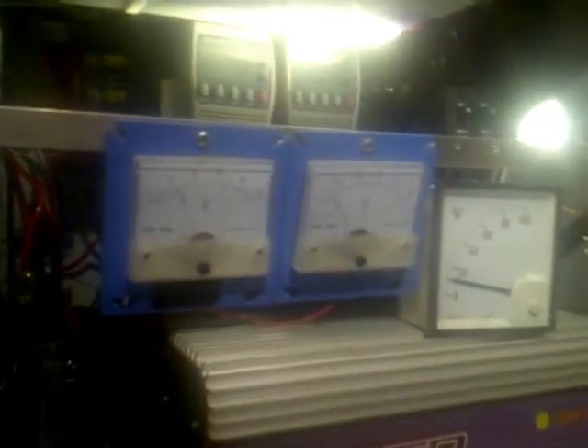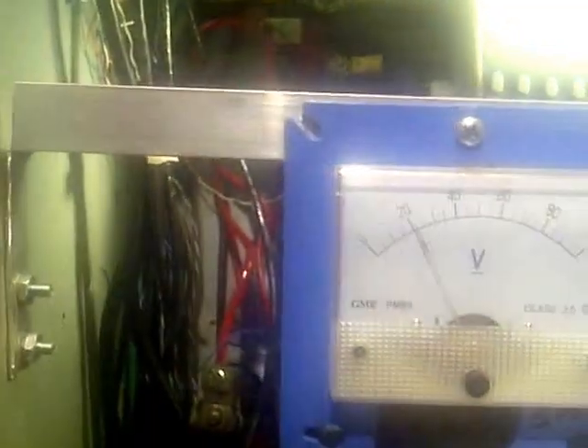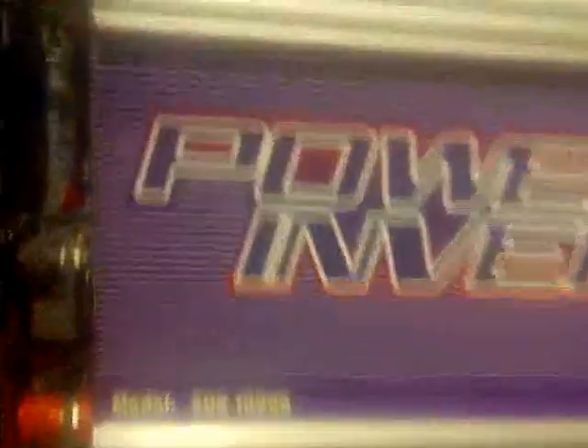What I wanted to show you is what I'm doing with these grid-tied inverters in the system. We have three turbines on my house that come in — they have their own rectifiers in the back, so it's all AC converted to DC. When you come down here, there are three positive bars and three negative bars. Each turbine has a positive and negative bar, and off each positive and negative, it has its own inverter set.